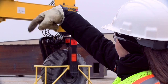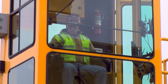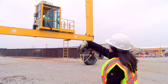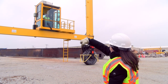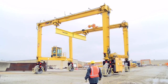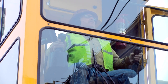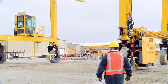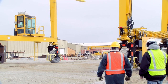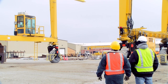If ground persons are used in conjunction with the operation of this crane, follow the guidelines of your company regarding where ground crew personnel should be, based upon the application, yard design, and the safety rules of the company. MIJAC recommends that all ground crew be within sight of the operator before the crane is operated, and that they stay in communication with the operator while the crane or any part of it is in motion. If any ground personnel move out of the operator's sight, the operator should re-establish communication with all personnel before operating the crane, even if the all-clear signal has been given.